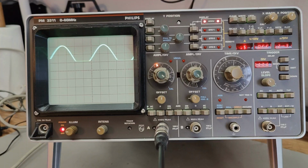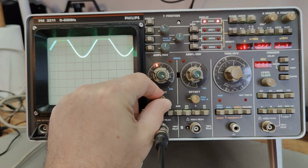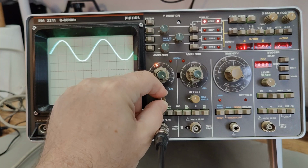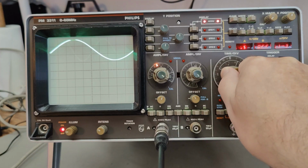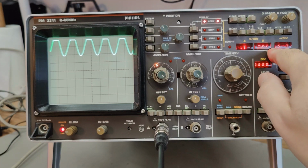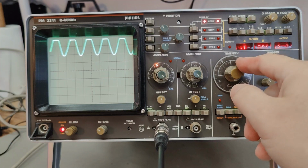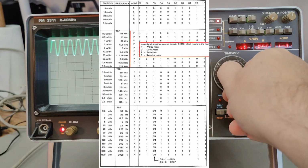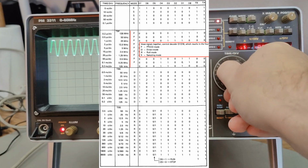So this is what I wanted to show. This is a 1 kilohertz signal, and now the signal is truncated like that. So this is our input range. It can be almost 3 divisions, 2.5 or something like that, right? So let's just try and keep it in the middle here, and then you see the time base here. Oops, see, there's a new problem, and this goes from 0.5, and that is exactly when the time base is changing the behavior of its modes. It's activating this input sampler, and then it goes a little bit in and out of that system. So there's definitely a problem.